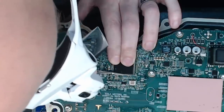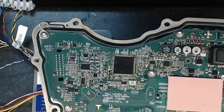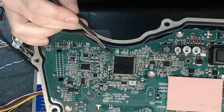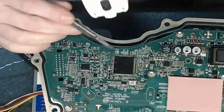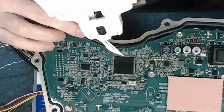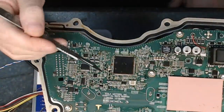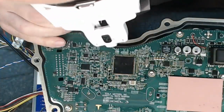Now, yeah, that worked perfectly. So, as you might expect, with a normal QFP package, this would, at this point, be ready to just pop off there. But in this case, it won't, because as we say, underneath this is our power pad. And so it doesn't want to do that for us just yet.